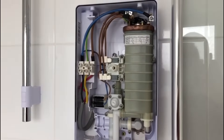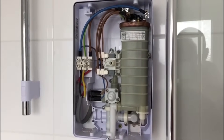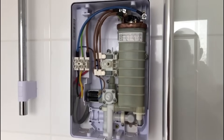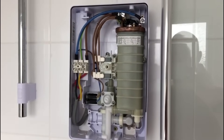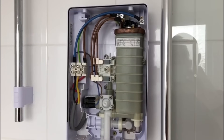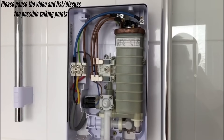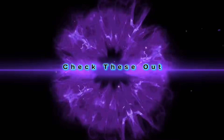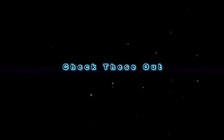So that's something that's going to go down as an issue on the EICR. The report will pick that up and recommend either downgrading the shower or upgrading the cable.